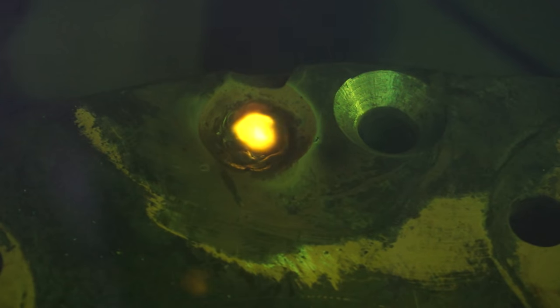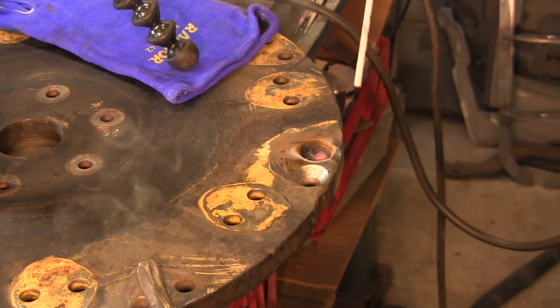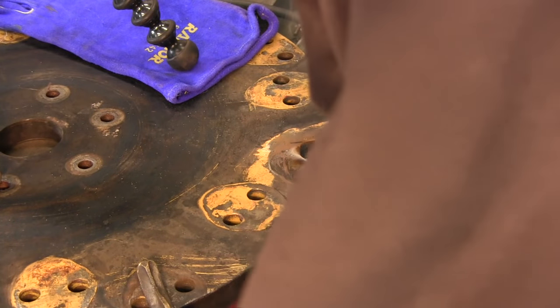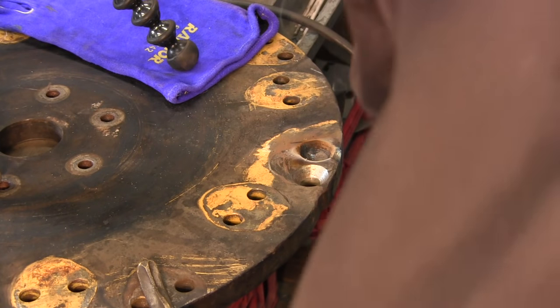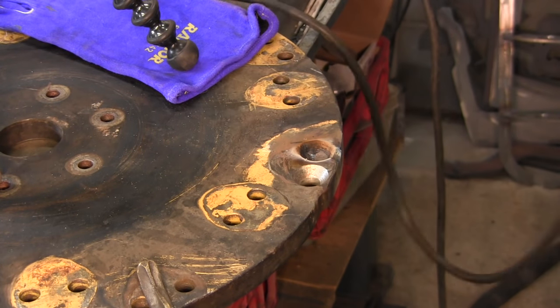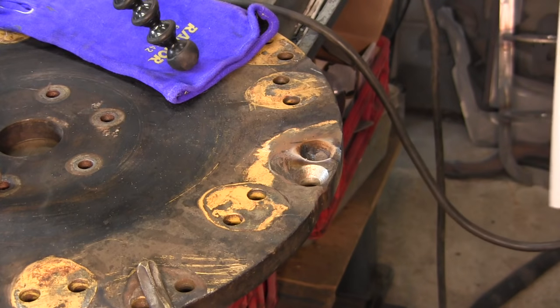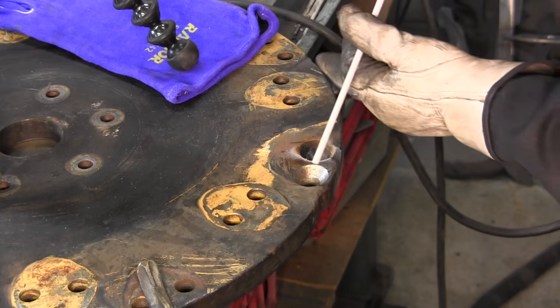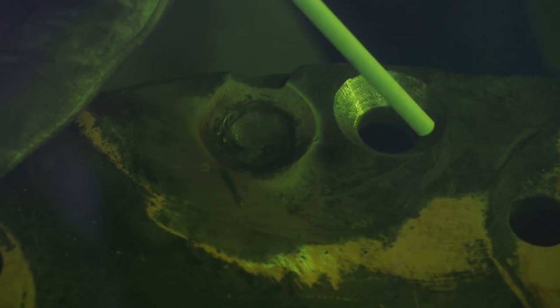I'm going to pick this hole to start. I advance a little bit and then roll it backwards into the hole, holding a real short arc. Come right around on top of that — you can continually weld 7018 as long as you're in the vertical and the flux is flowing down through the hole. Close up that one. The rod is too hot to hold, so I'll sacrifice it and get a brand new one for the other side. That was only two passes around and I was able to close that 5/8-inch-plus hole up.